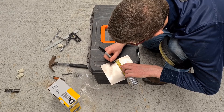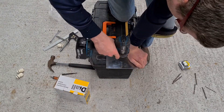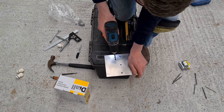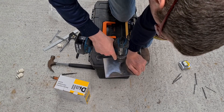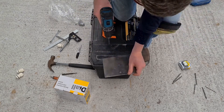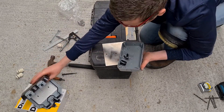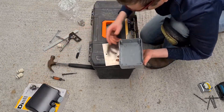First I fabricated a stainless steel bracket to mount the socket to the steel garage. 7mm holes were drilled in the bracket using drill bits. Next I measure and drill the holes in the socket surface box to mount the stainless steel bracket. The holes are 7mm in diameter.